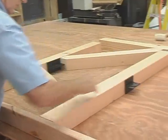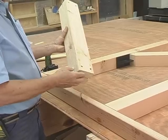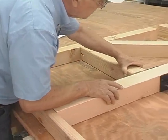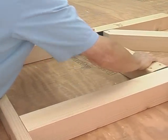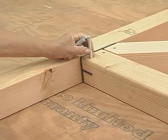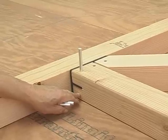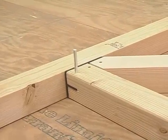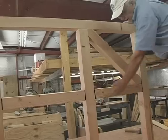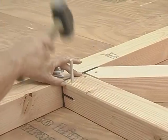All the connectors have been installed. Our pieces have been notched and drilled to accept the locking pins, and this is as easy as it is. We take our pins, we drive them into these holes, and they go through the bracket. But they don't go through the wood — they stop about a half inch before they reach the opposite side. The reason we do that is when we stand this wall up, that's going to be the interior of the building. So you're not going to see any fasteners on the interior of the building. It gives it a nice clean look.